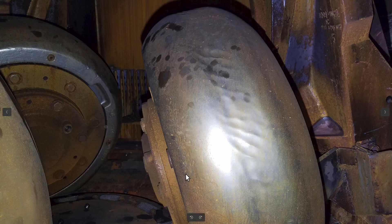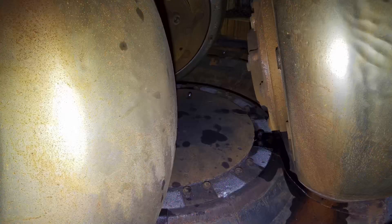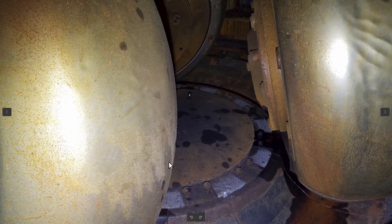Another picture of the roller showing some roller wear. You can see the bearings are in here. When the oil plug is here it's being prepared for maintenance — this is where you add the oil inside these. This shows the center grind table where the coal drops down. These are the cast grinding sections showing the three rollers inside. Basically, the coal hits this, drops down here, gets ground. Air comes in the sides, sweeps the fine coal up to the top where it's classified — anything too large is rejected and drops back down.